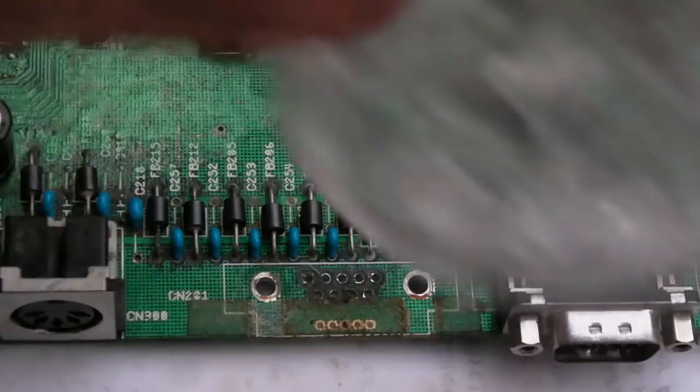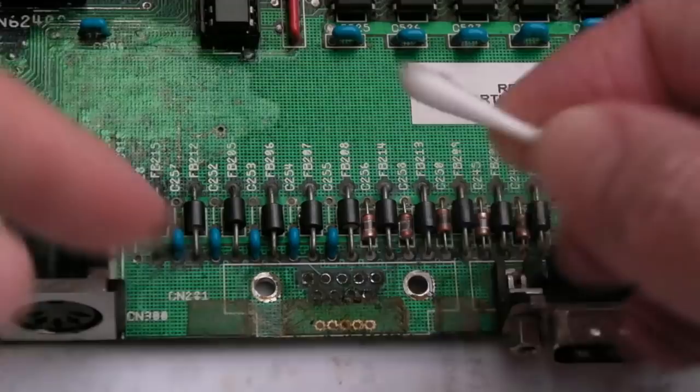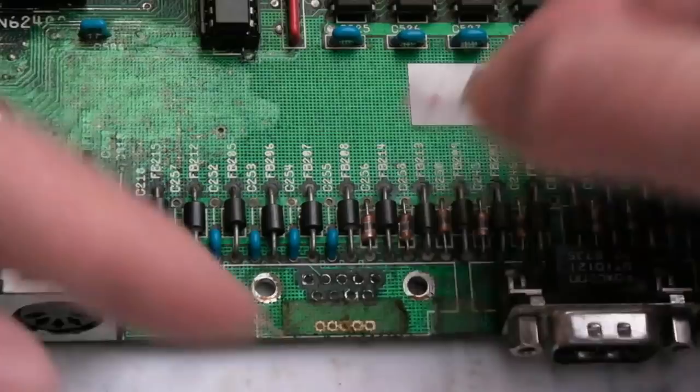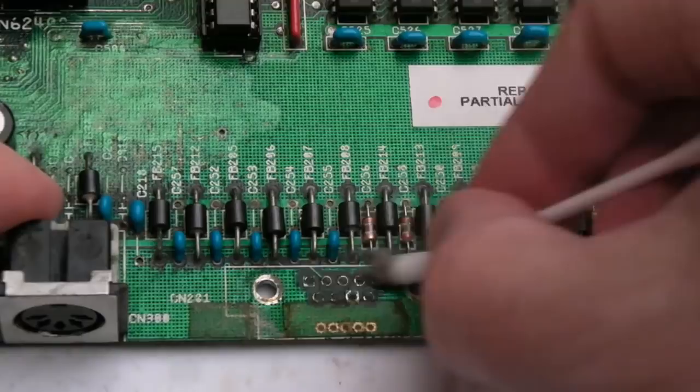You know, you've got what looks like a combination of corrosion, but also some of the spray on stuff here could be some like rust that is joining some connections. It really could be that simple. Maybe this is the answer. So we'll use some vinegar here initially. That's like a sticky pad there, that brown thing, but anyway, we'll use the vinegar initially, and then we'll do the same thing we did with the resistor array, you can't quite see over there, which is to get some flux on, tin it up, inspect it.